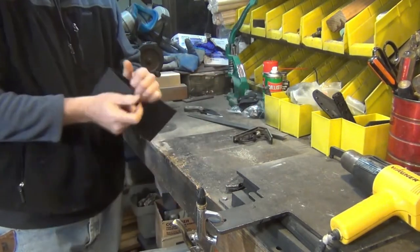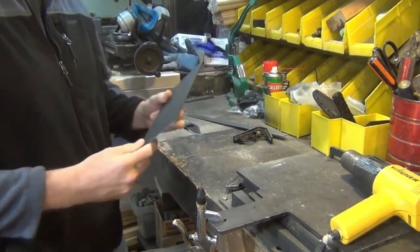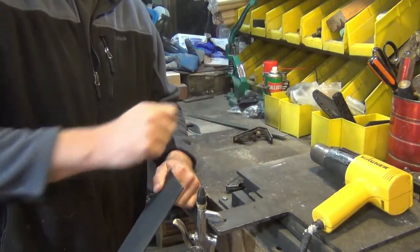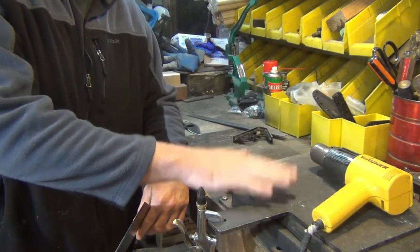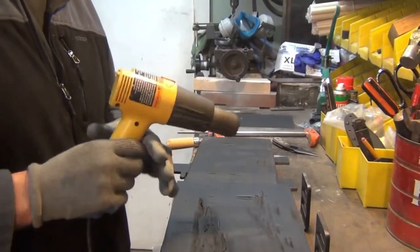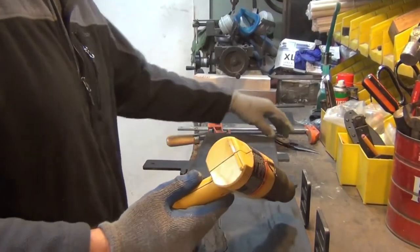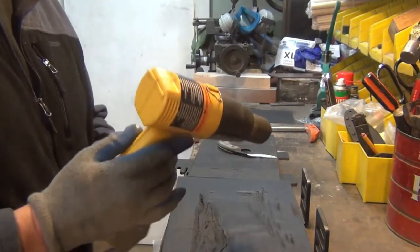I'm going to heat this up. I have a hot plate that I use — you could also use a toaster oven or a heat gun, and then you'll need to do a press. I buy all my stuff from Knife Kits; they have everything you need to make holsters and sheaths. I'm heating the kydex on the hot plate and also heating up the pad to make it a little softer. I'll also heat up the knife to help it conform.